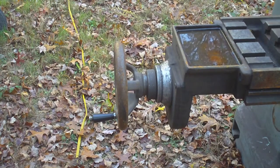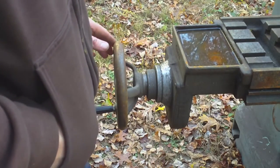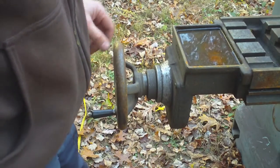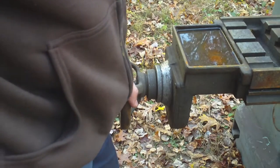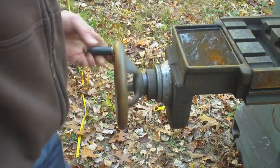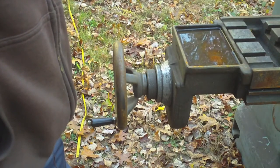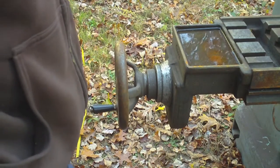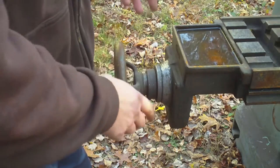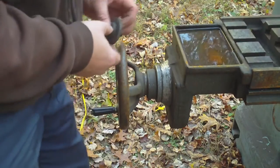I'm back to work pulling parts off this parts machine. I wanted to show something interesting — I remember theorizing when I was disassembling my machine to get it down the basement that these hand wheels should have an ability to freewheel, so that when you're using the rapid traverse the handle wouldn't be whipping around really fast. I theorized that mine had been modified, and now I took this one apart and sure enough...